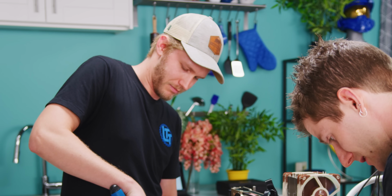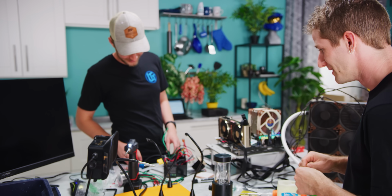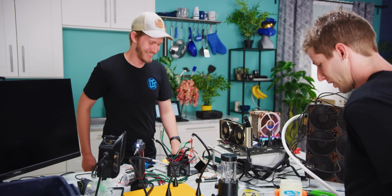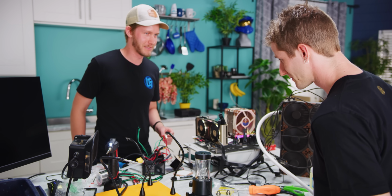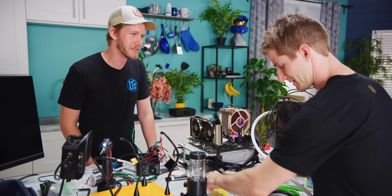This box right here might be the sketchiest thing I've ever done. It's a bit of a mess, and there's AC power in here. We've got what's going to be nearly 600 watts going through lever nuts. Are we gonna start a fire? It's all within the rating. These are rated at 32 amps, and we're expecting 32 amps, so.